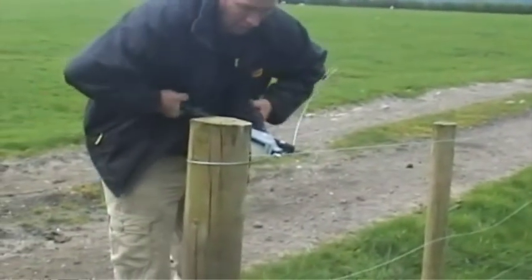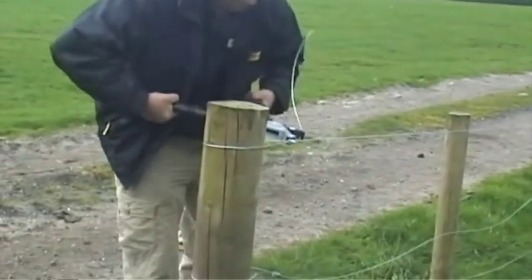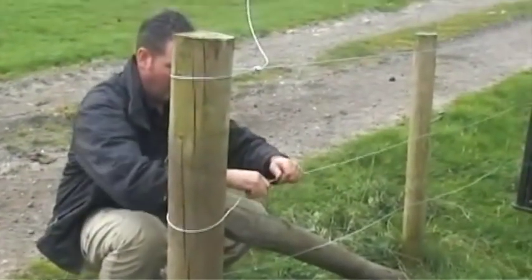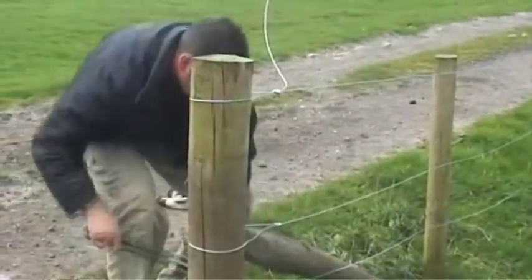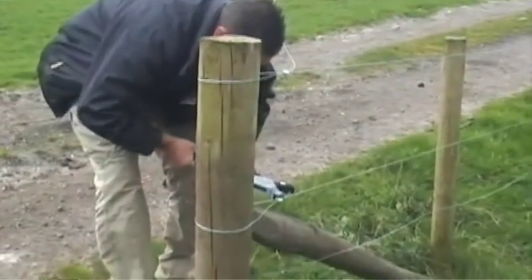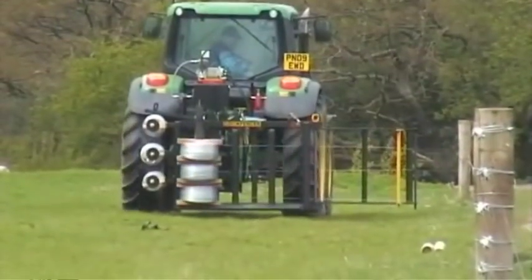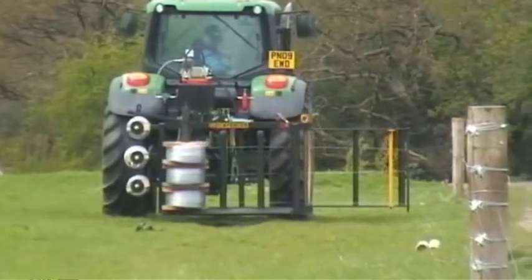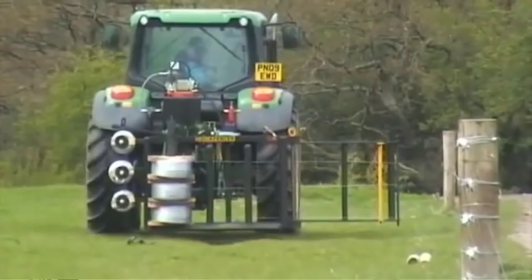Here we are finishing off with gripples. Remember, it's fully tensioned to start with, barring the last couple of meters. So you just put the, it's still on the quick fencer, and then you hold it. Here we are doing it correctly with the middle roll going the opposite way. That gives it tension. This is with rolling resistance.